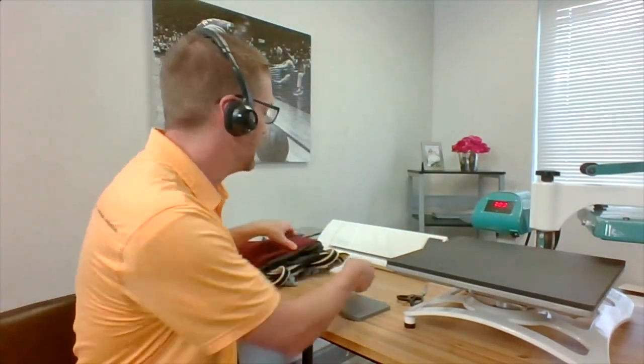For those of you operating with a less-than-quality machine, this is going to be a great upgrade. What we've found is there are a lot of machines out there that not only are inaccurate, but even if they're accurate, if they have a thin platen, they lose temperature after multiple applications. If you were to do a job of 20 shirts, by the time you got to shirt number 20, your temperature is not going to be what it was originally set for. With this press, we've designed it to hold the heat — it has high-quality components that trigger from the control board to the heater when it's losing heat, so it keeps triggering the heater to stay up to temperature.